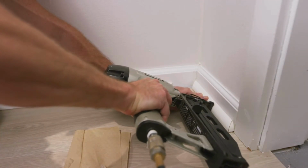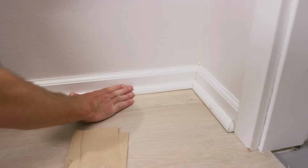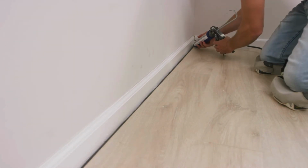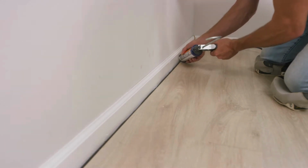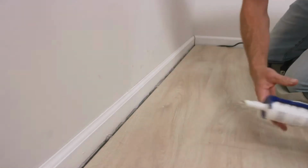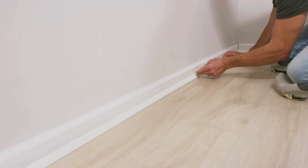It's important that you do not use acrylic sealant. If you choose to use the PE foam backer rod instead, insert the 3/8-inch compressible PE foam backer rod to fill the expansion gaps and cover with 100% silicone sealant, ensuring there are no gaps. Then, cover with a standard quarter round to finish the look. Apply silicone sealant anywhere the flooring meets door frames or other fixed objects.